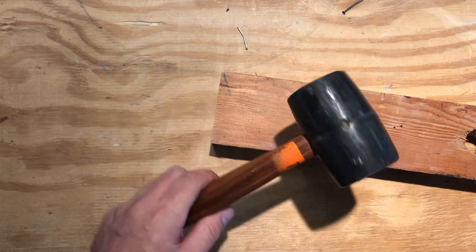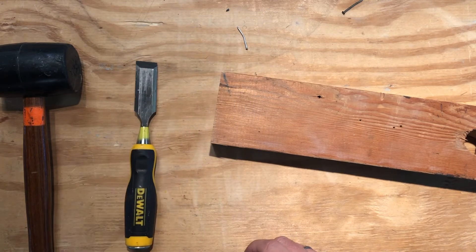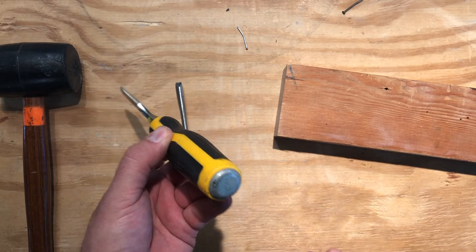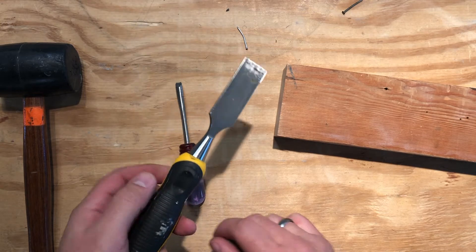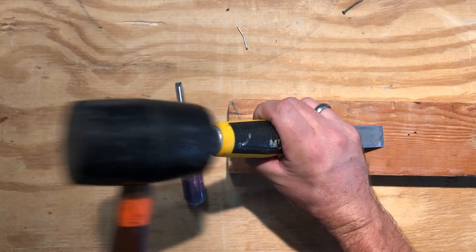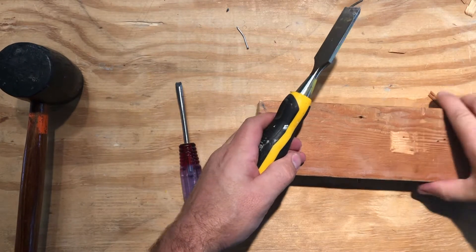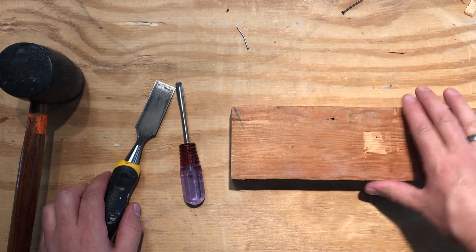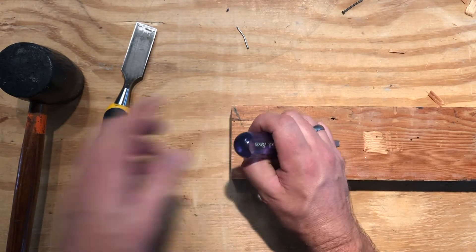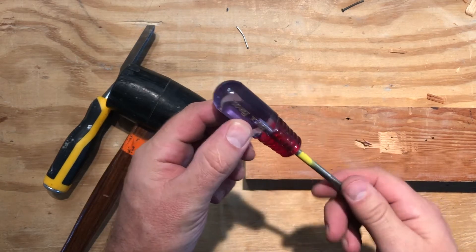It's also good to use against another tool, such as a chisel. These are chisels that are used with a mallet. Now, some chisels have a metal back, which means you could use it with a metal hammer, but I don't recommend it. I recommend that you use a wooden mallet when you use your chisel. If I was going to do a lot of chiseling, I would put this in the vise so that it didn't move around on me. Here's a chisel that does not have a metal back — don't ever hit that with a metal hammer. You'll just shatter the end.